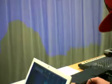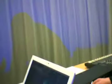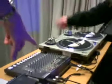So it's the aux output on the desk into the input there. So it comes output of mixing desk into input. Just into input, either or. Actually, if you do it into left, left one's a reverb, the right one's delay. That's it. And then that comes out of the aux, so aux 2, into the input there.